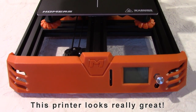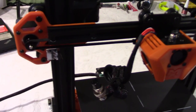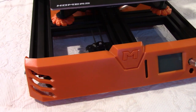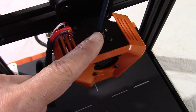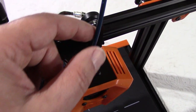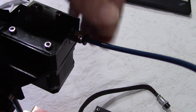Our printer is now fully mechanically assembled. We just need to install the bowden tubes and all electrical wiring. I ended up with two extra screws with T-nuts — I think they came from the fact that the previous model had a separate power supply and control board, while this one has only one unit. To install the bowden tube, push all the way down — you'll feel a first resistance, but wiggle a little to go all the way to the nozzle. I prefer to use high quality Capricorn tubing rather than the white tubing that came with the kit. Make sure you push all the way inside the feeder until the tubing stops.